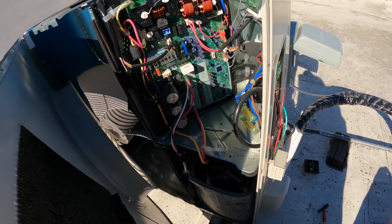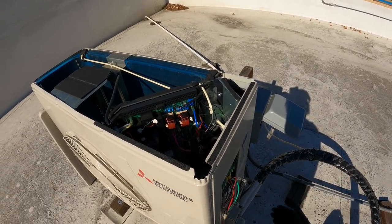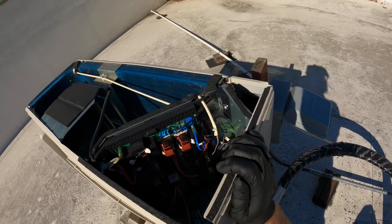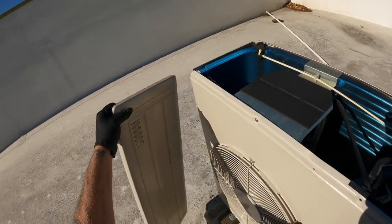Let's carry on. Okay, so I've checked the fuses. For me, depowering it and then powering it back up, checking stuff. I had asked the customer earlier in the day to reset the breaker. I don't think they did. I do have an LED light now. And I'm wondering if the power cycle reset the unit.